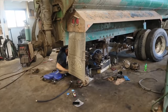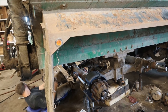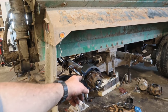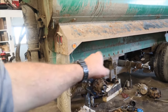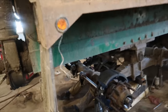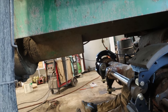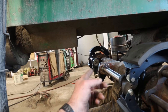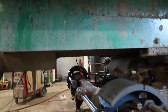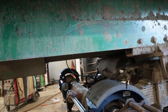Another project we're working on is this green Dillard trailer. It needed brake shoes, and once we got it torn apart we realized it needed about everything — swapped the S-cams out, new slack adjusters, new air chambers. We had a wheel seal gone on the back right corner, and we decided to do all brand new bearings too. You've got to pull the hub off to get the S-cam out. Being that this is a trailer, it's got the longer ones on there. In order to get some of this stuff apart, you've got to replace other pieces — slack adjusters, canisters, the ends stripped off of them. So we decided to replace the air canister, and when you take the air hoses off, the hoses ended up stripping off too, so we had to replace all of the hoses going to the air chambers.